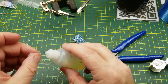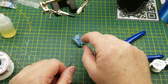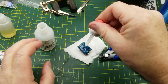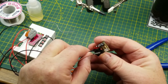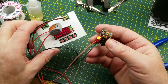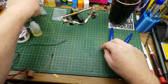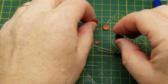One downside of this homemade flux — I'll link the video where I made it — is that it leaves a really sticky mess on the board. So I'll use a dollar-store toothbrush and some isopropyl alcohol to clean it up. Now let's connect it to five volts and see if it draws any current. The power LED comes on and it's drawing about five milliamps — that's a good sign. Nothing's getting hot, so there's a good chance it's working. Let's move on to the receiver kit.